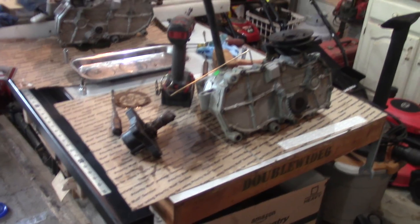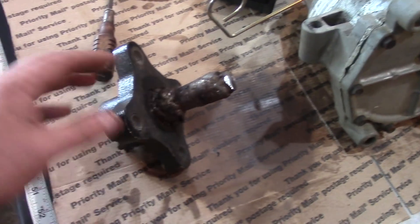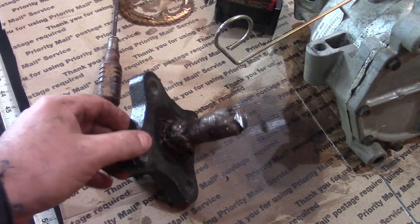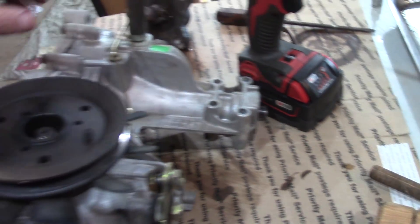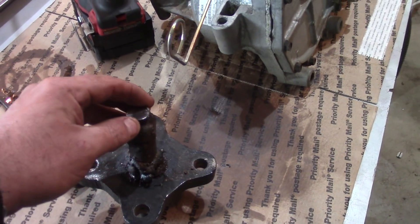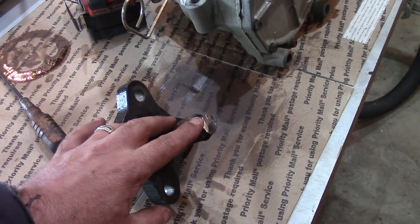I've got the Hydro-Gear transmission up on the table. The first thing I did was cut off the hubs — the previous owner tried to weld one and it broke, so I had to cut both off because the shaft needs to slide through when you split the case, and I didn't want any metal debris inside. You also have to drain the oil — I'll pull the plug now. I'll link the upgrade kit in the description. The standard shaft is three-quarters of an inch, and even though the Amazon listing says three-quarter inch replacement, it's actually a one-inch upgrade.